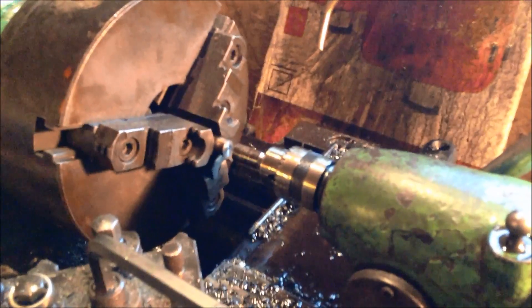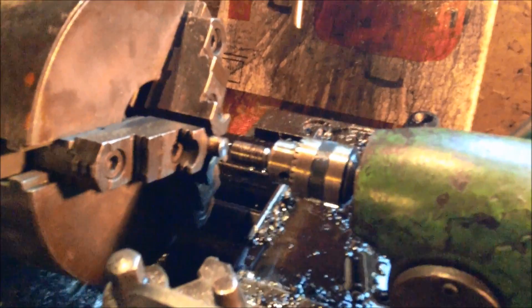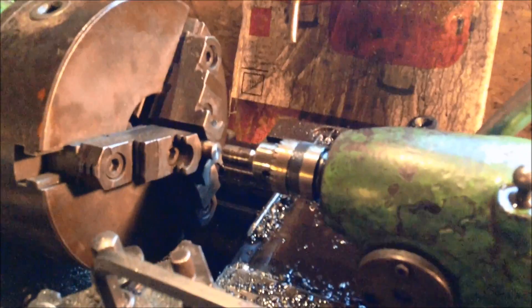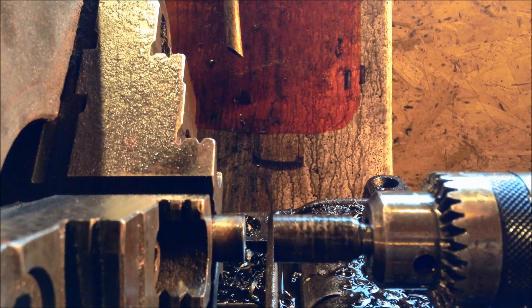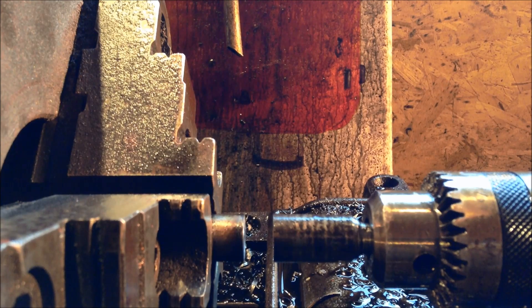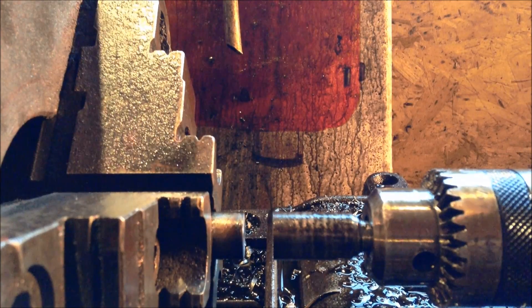This smaller piece is just over half inch — maybe 9/16, something like that. I'm going to go and try to friction weld this; it should go a lot better. I'm going to require both hands, so I've got the camera set up on the lathe now so you can clearly see the work. I'm running at 800 RPM — not much more to tell. Here we go.